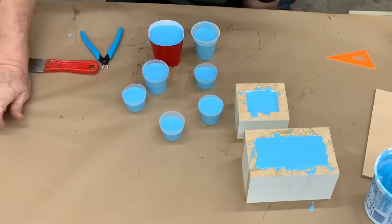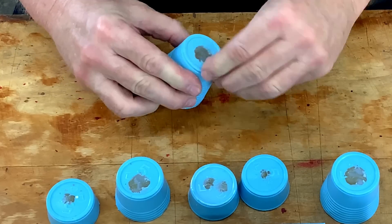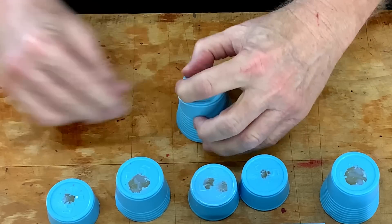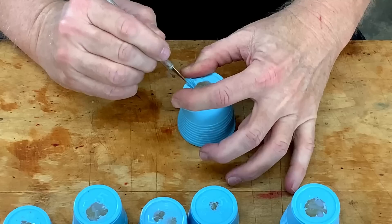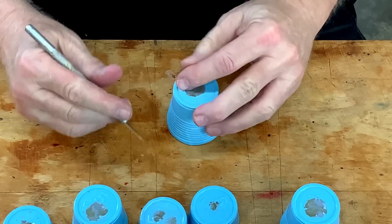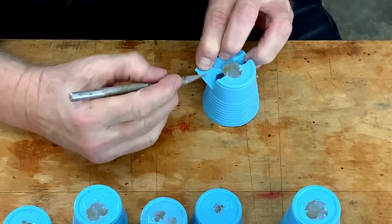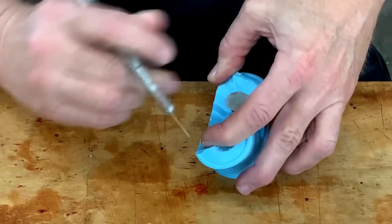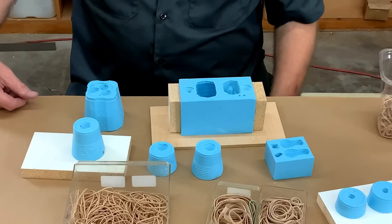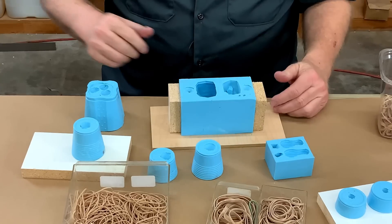We have something like 18 or 19 parts to cut. I'm not going to make you suffer through all of that, but let's just cut one to see how it goes. First thing I do is look for where the vent is, because the vent tells me where I want to cut. Starting the cut is always the hardest part — once you get it started, it tends to go down easier and easier. I want to cut just enough to free the part and no more. That was the nose — easy. I got them all cut and ready to go. Now let's band them up.